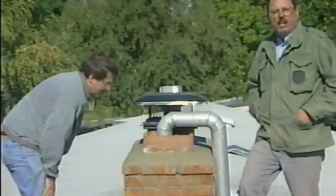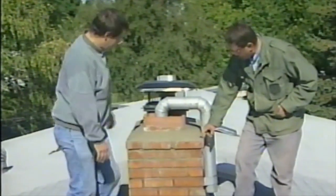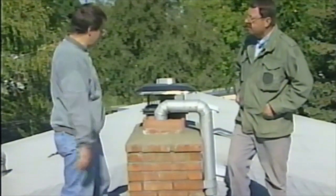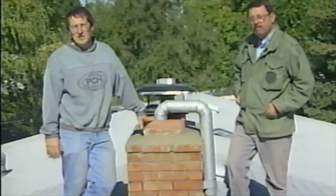And again, we've completed another project as Joe examines his handiwork. That's a nice finish job you put on. Worked out good. That's a good job. Pat it on there and it takes the trowel marks off and brings a little bit of the cement to the surface, makes it a little bit harder. Should work out real good. They shouldn't have any leakage out of this whatsoever.